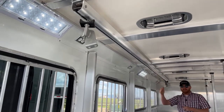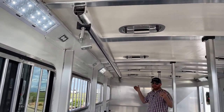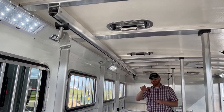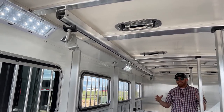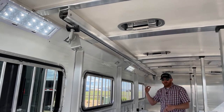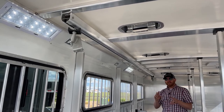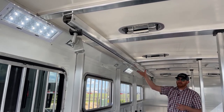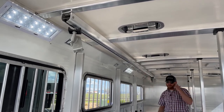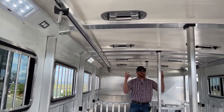There's a rail that goes down with brackets hanging off — this is a 14-foot rail, the same style we use on our cattle trailers for traveling gates. What you can do on those brackets is take a 12-inch barn fan. That works best because 24-inch fans hang down too low. You can snug the 12-inch fans up against the rail where you want them, then plug them in and run fans. There are also some heaters you can get.